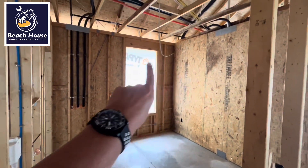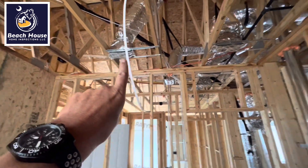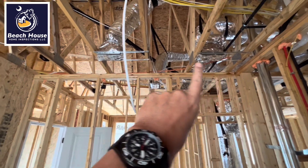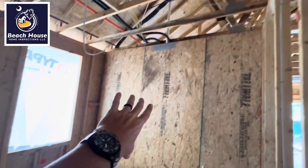I'm going to take you to one of the small bedrooms. Here is our source of heat loss — we have a window. That's our supply, that's our return, and they're two feet apart. Air from that supply will never properly condition this part of the house.